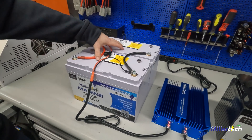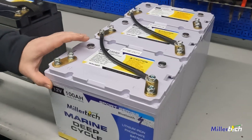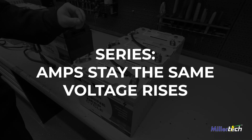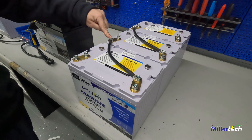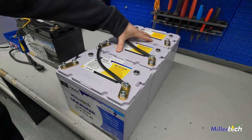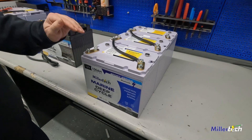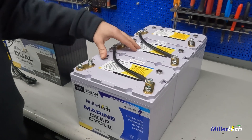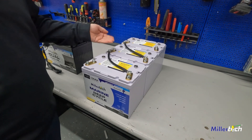So now you have a 100 amp hour battery pack right here. If you look over here to the right, we have three 12-volt, 100 amp hour batteries connected in series. The best way to remember series is: if you connect batteries in series, the voltage raises. So 12 volts plus 12 volts makes 24 volts, add another one and you have 36 volts — so now we have 36 volts in this pack. When voltage goes up, it becomes serious. Serious voltage means your batteries are connected in series. Parallel means there's a pair of batteries — voltage is not rising, only the capacity is rising.